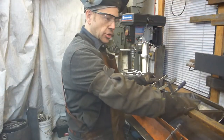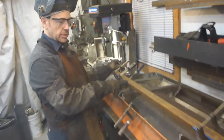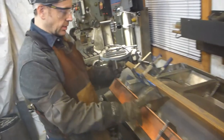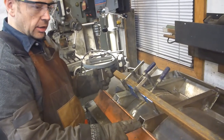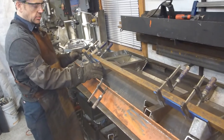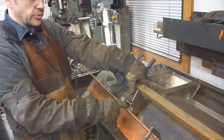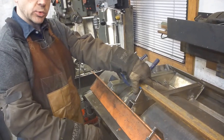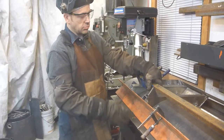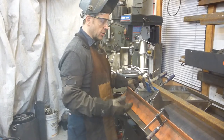Okay, we put back the tube here to keep that straight. It was underneath these brackets, now it's on the top. We're going to add those gussets. At the same time, we cut the excess material here on each and every section. And we're going to put the gussets there. We leave it open on each and every side because it's going to collect water if we close it, unless we do a super good weld. But let's keep that open so it will just drain water if there's any water coming in.